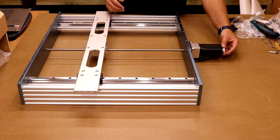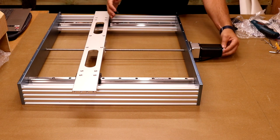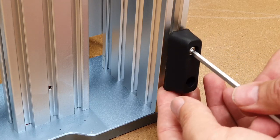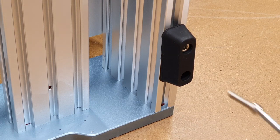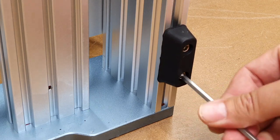At this point, take a second to turn the knob on the stepper motor and make sure the axis moves smoothly backwards and forwards with no play in it. I'm also installing the rubber feet now with M5 20mm bolts. The instructions show this much further into the process, but I'm installing them first because I'm worried about too much weight being on the machine when trying to lift it to install them later.